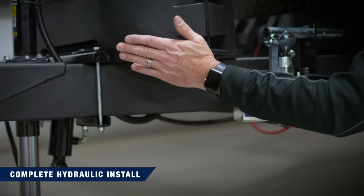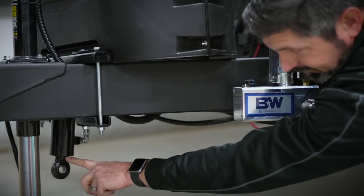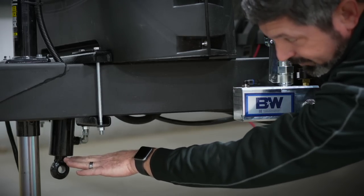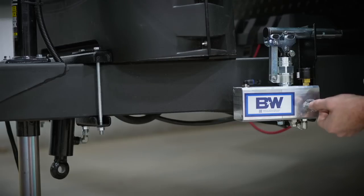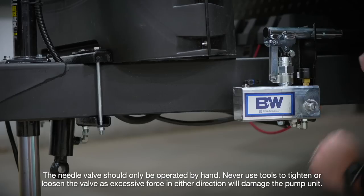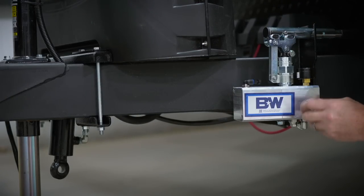We've reinstalled the propane tanks and the cover. The next step is to make sure the hydraulic cylinder is fully retracted — no chrome of the cylinder should be visible. If yours extended during installation while checking pump clearances, close the needle valve on the pump assembly and crank the handle just enough that it fully retracts with no chrome visible. Once fully retracted, reopen your valve.